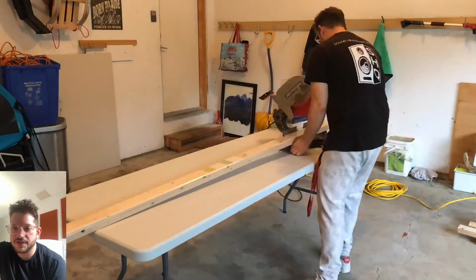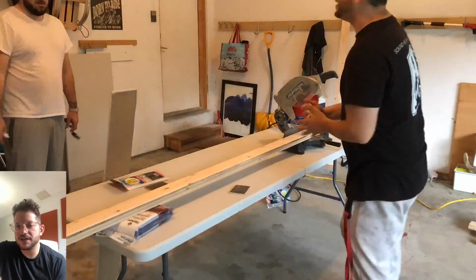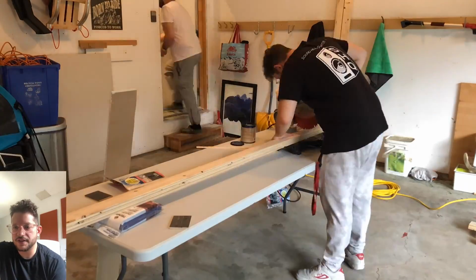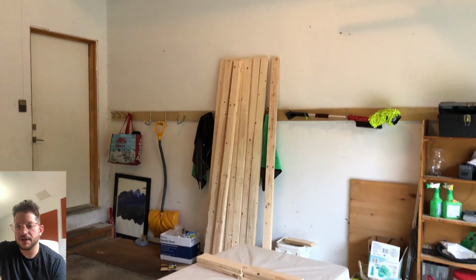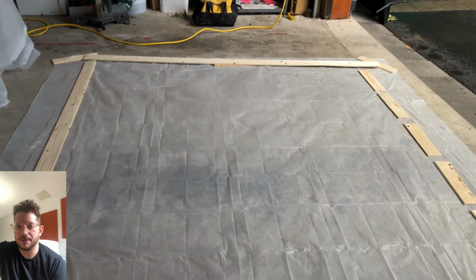So we're using this pine. It's just a tongue and groove kind of situation. So I'm just getting everything cut. And we left about a 1/4 inch gap from the upper bulkhead there in the ceiling, just to make the installation process easier, but it's also where we added our lights in at the top of the wall, which you'll see in a little bit.